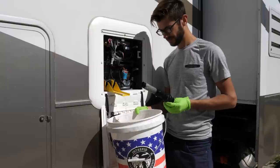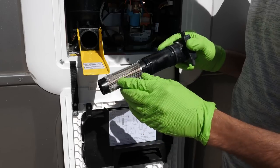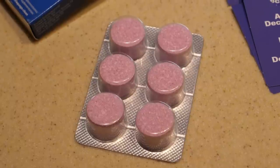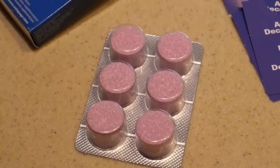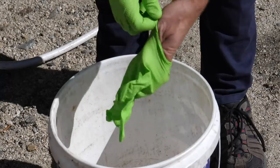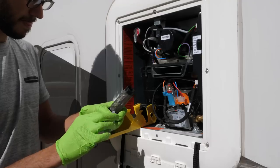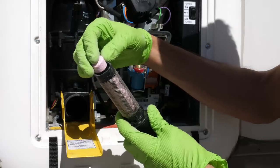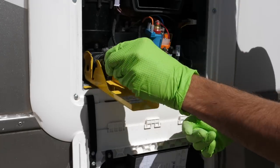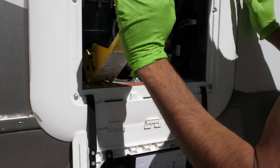While the water is draining, remove the water inlet filter and inspect the mesh — rinse it with clean water if necessary. The next step is filling the water inlet filter with six AquaGo decalcification tablets, or the contents of one blister pack. Because the tablets contain a mild acid, wear protective gloves to avoid contact. Insert the tablets into the end of the water filter inlet and reinstall the water filter inlet into the drain port on the water heater.